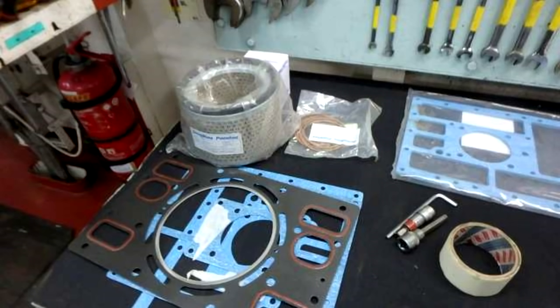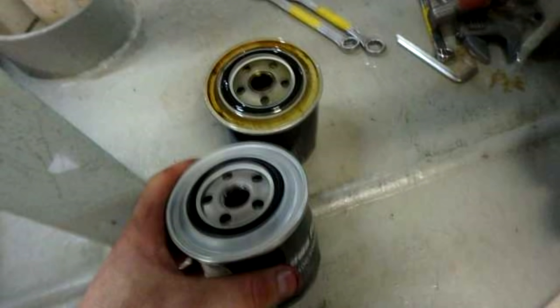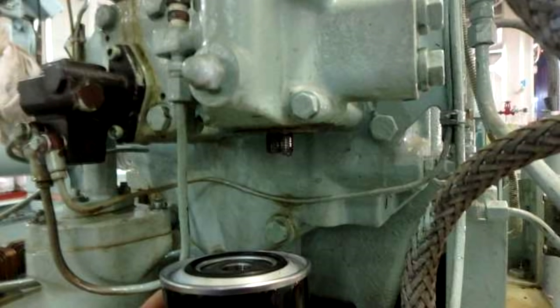The overall condition that we have seen in this cylinder and piston is quite good. It's very, very nice. And it's not necessary to overhaul the piston and the piston rings. If there was any scratch or damage of piston rings, for sure they would be scratched, because this kind of piston is made of aluminium and it's really, really easy to get a seizure. But the condition was fine. We took measures with an inner micrometer to determine that the condition of the cylinder is proper.